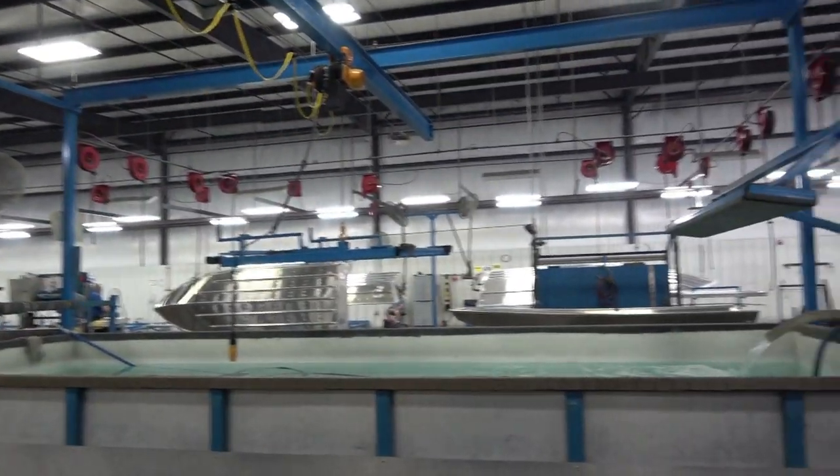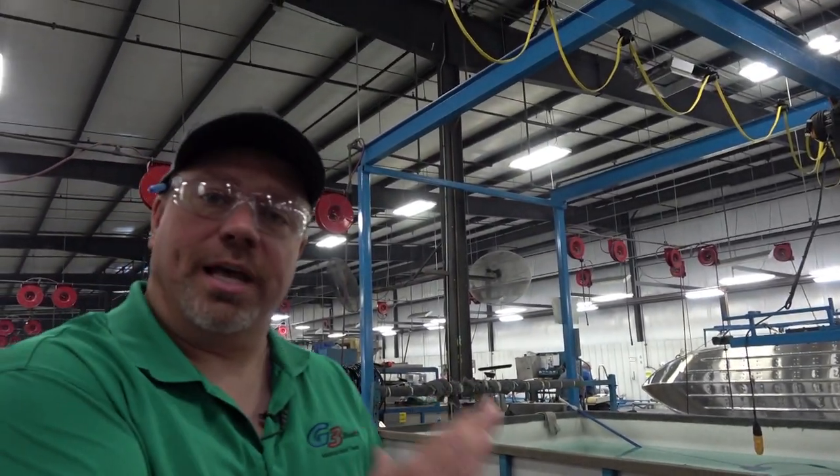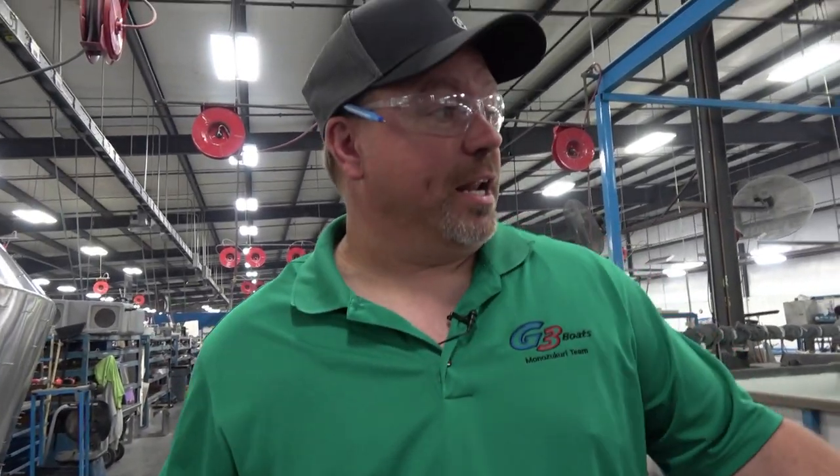After this, the boat goes into the test tank and stays for 10 minutes. We beat it — we take a rubber mallet and beat it down to simulate rough water. Then we leave it in there. If it leaks, we take it out, repair it, and put it back in for another 10 minutes. I've actually had to fill boats up with water just to find a seeping rivet, because sometimes after those double plates it kind of hides itself — you fill it up and the leak drifts right off the rivets. We fix it, dry it out, put it on the line, and build it.